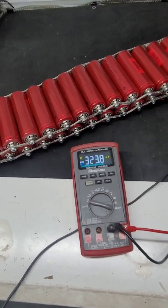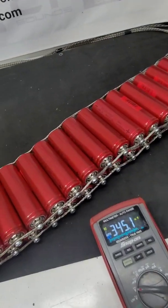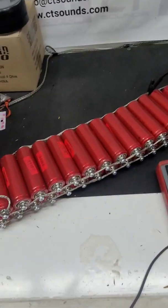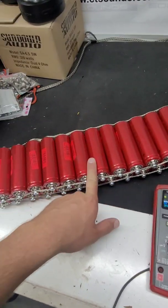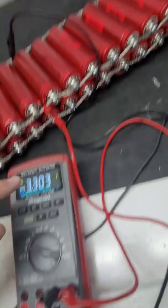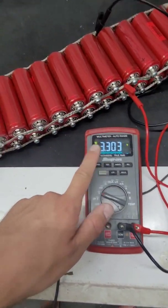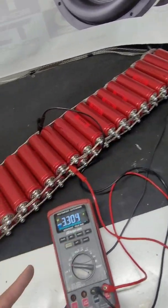You can see here we have all of these connected in parallel, so all of the positives and all of the negatives are connected the same. If we take this clip from the voltmeter and hook it up to the negative and positive terminals, we should see our average volts is 3.3 — which matches what we were seeing earlier on average. So what you want to do is leave them all connected just like this overnight. The ones that are a little low and the ones that are a little high are going to average out. This number probably won't change a whole lot, but it's very important that you balance these out, because right now you can't see what's going on since this is an average voltage — some are going to come up, some are going to go down — but overnight they'll become all nice and balanced with one another.